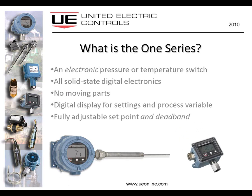The 1 series is an electronic pressure or temperature switch. So we have various sensors available for gauge pressure, differential pressure, and we also measure temperature with this device. It's available in a Div 1 package, which you're looking at on the left side of your screen. Kind of looks like a transmitter. And on the right-hand side, that's a Division 2 model. Both are electrically identical, but as you can see, packaged quite differently for various hazardous location needs.